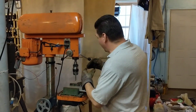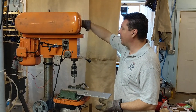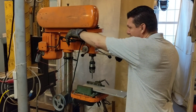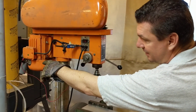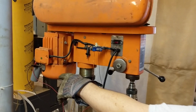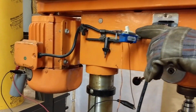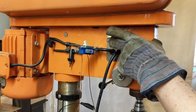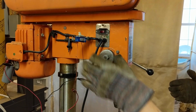My drill press isn't a reversing drill press — it's just an old one. I have it set with the belts to the lowest speed right now. This switch is just hanging on here. What I've done is disconnected the hardwire into the start capacitor and put the switch in series with it. By turning the switch on, it starts up just like normal because the run capacitor is in there.